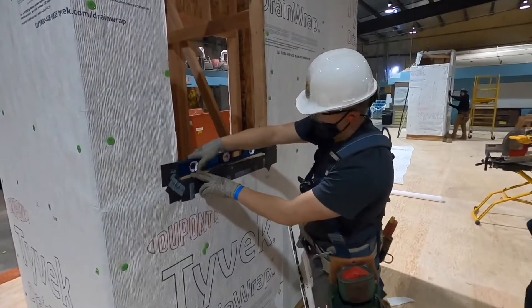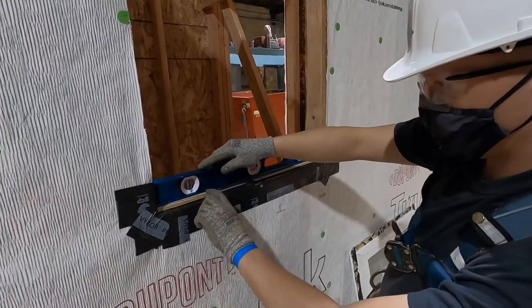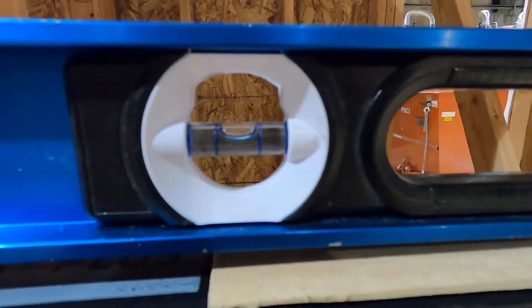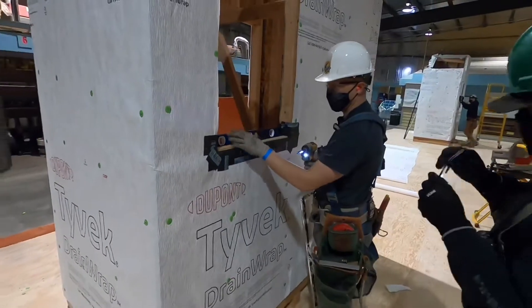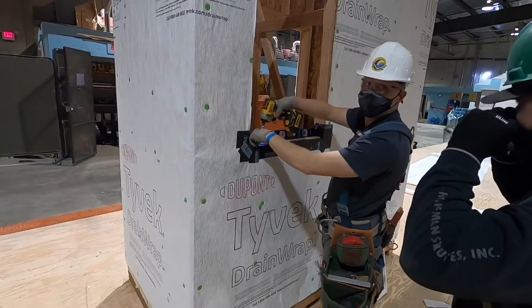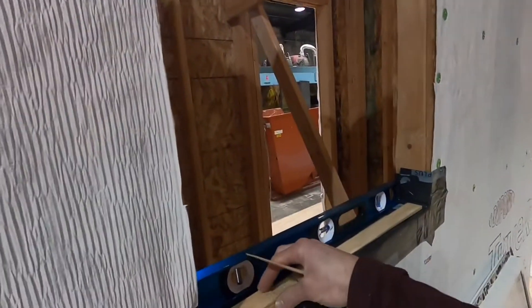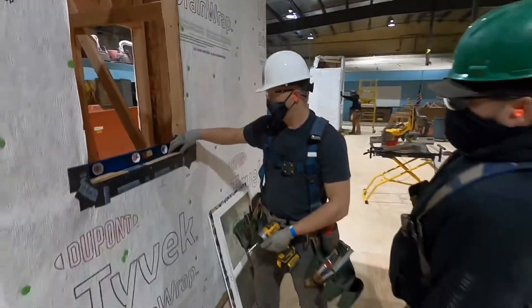Put your level on there. Don't do that — the window is going to rest on top of the head of that screw unless you've got flat nails. It's okay if you can just put the window right on top of it; you don't have to fasten those down. Keep it up towards the outer edge and put the window in.